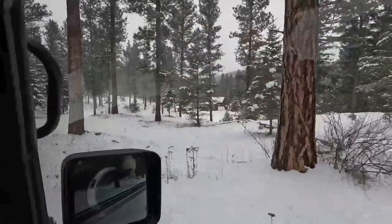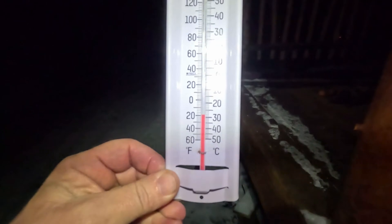What is that potential damage? It's not actually the battery cells themselves — it's the cases. The metals and plastics contracting in the cold can cause cracking, and that's bad for any battery whether it's lead or LiFePo4. So I had to race up to my cabin, move my batteries into my back room, which happens to be heated, to keep them above freezing. It all worked out — it was a bit crazy, but we got it done.